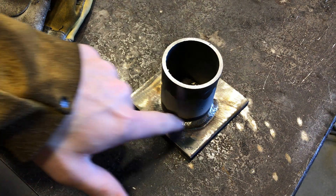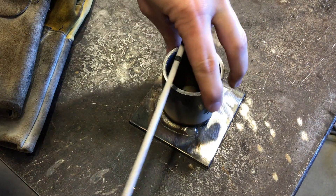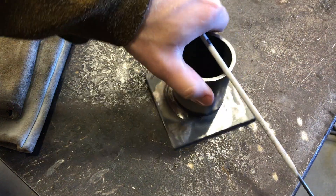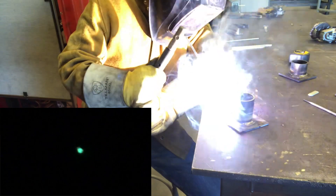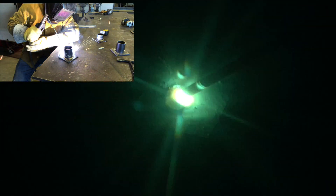Now we've got our first pass in. We have two options: spin it and tie into the weld to continue around, or start right here and weld back to the first bead. I personally like the tie-in from the back — it's more foolproof and easier. Starting here and welding back means when I'm done I only have one tie-in to worry about instead of all three. Try to keep that rod low if you can, if not just stay up on that wall and let it fill in nicely. The tie-in came out really nice and clean, with the bead following the pipe.